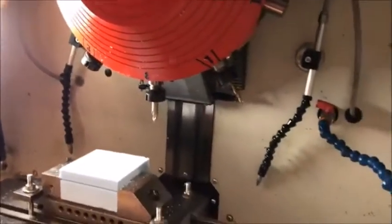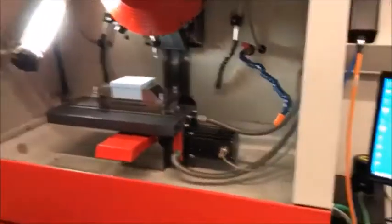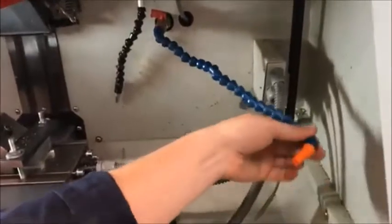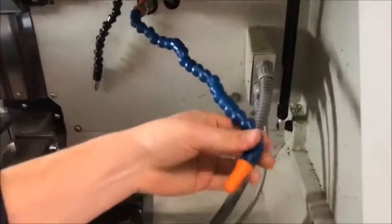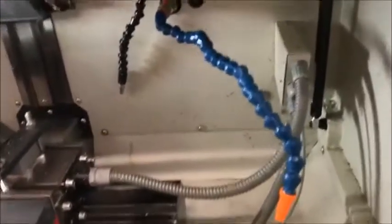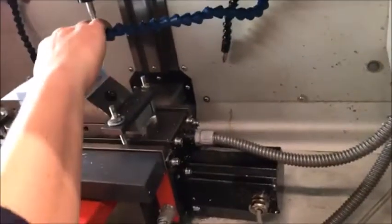These tools have been numbered — this is one, this is two — that's why we change the tool name in the code to tool number two. Now, usually when machining metal we need to reduce friction between the cutting tool and the work part, so we use a coolant. The coolant's first function is to reduce the friction force, acting as a lubricant.